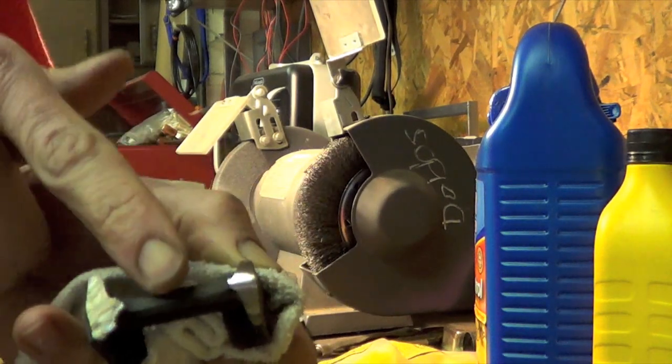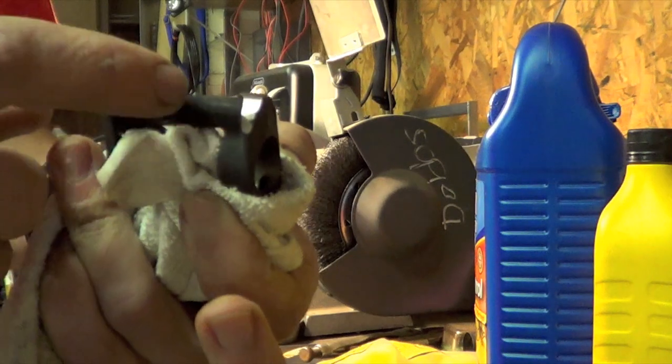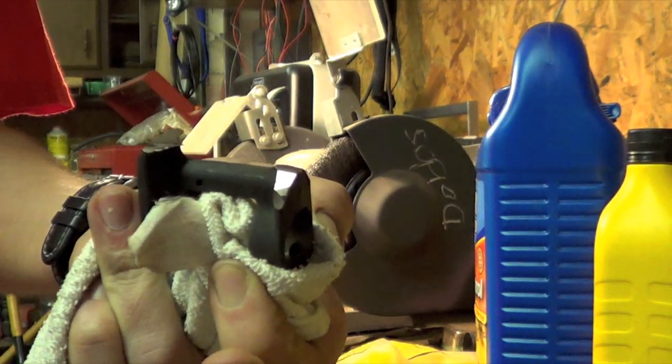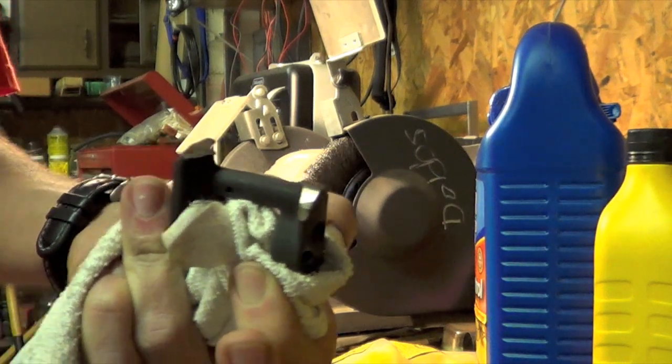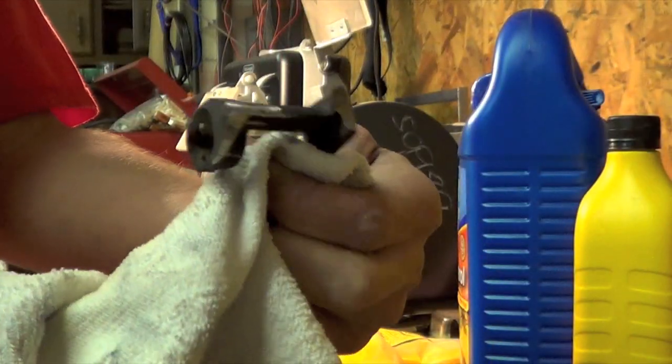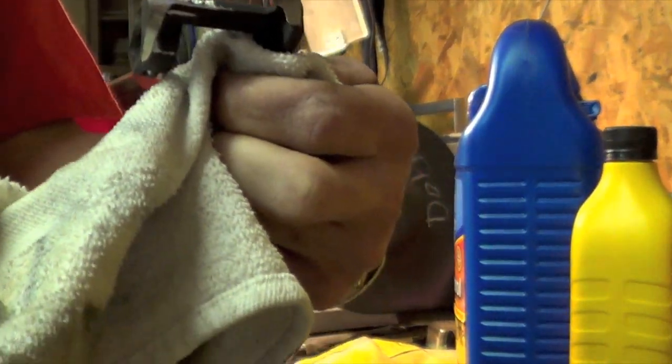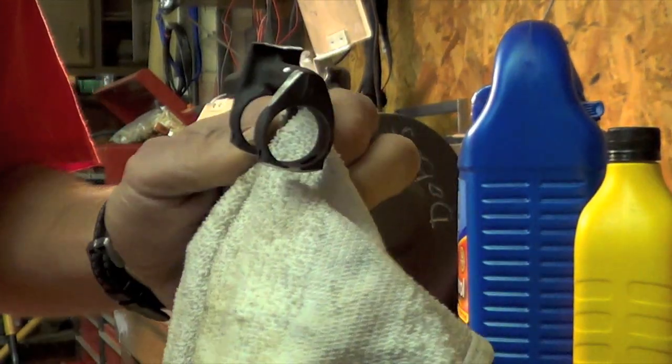and in fact you probably want to take a little bit off the top of the gas block, or the gas tube, which is exactly what we're going to do here next. But just keep grinding it down until we get there, and I'll show you the next stop. So you can take a look there at what we ground it down to, right where you basically just start taking some of that material off the top. That's where we're going to stop. The Troy rail, that should be plenty for it.